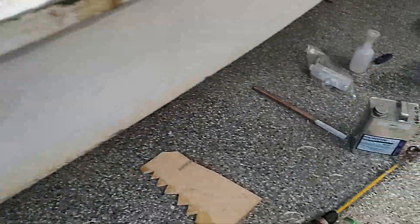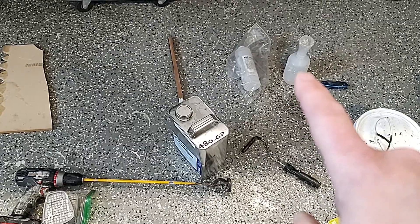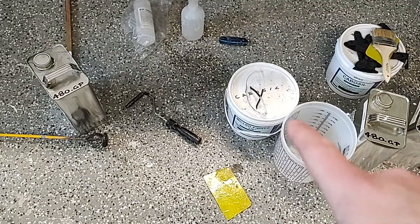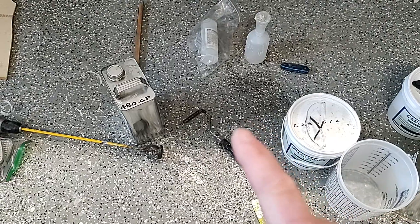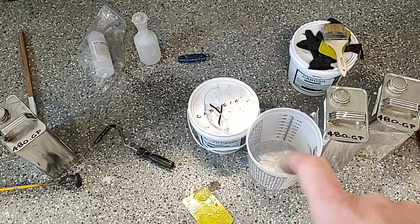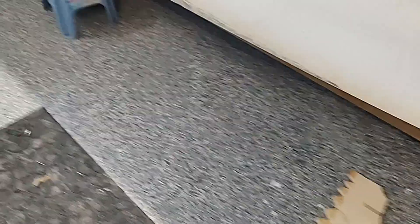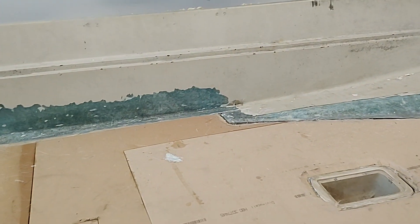So what are we going to do? You've got your polyester resin. Like I said, we're not going to put in the catalyzer right away. We're going to do some cabosil and some milled fiber — put a lot in, no catalyzer — put it in there, mix it up, and roll it in. You're going to feather in your peanut butter so you have a smooth surface. Then after that, you come back with your cloth, and after that you come back with your 1708, your layers of 1708.